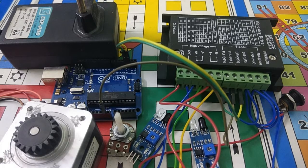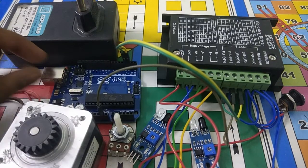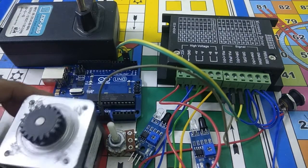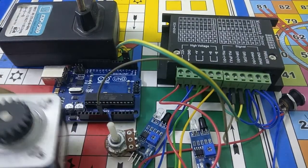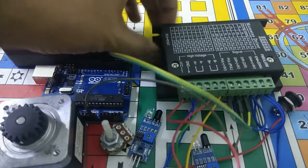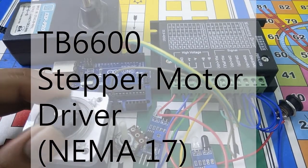The parts which we need are: Arduino Uno as the brain of the whole system, a 10k potentiometer to control the speed of the movement, a NEMA 17 stepper motor, IR sensor modules, and finally a NEMA 17 motor driver to control the movement of the NEMA 17 motor.